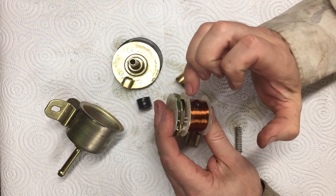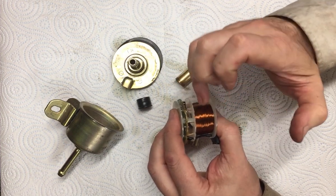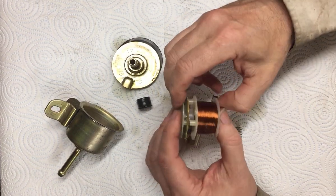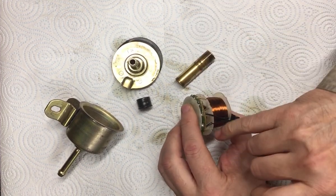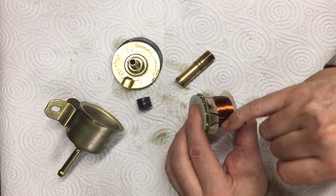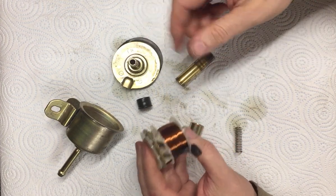So we've got a transistor there, a diode. That could be for when the magnetic field collapses, so it doesn't blow the transistor. Got a resistor there, and then a capacitor in there, that could be another diode. Yeah, it looks suspiciously like the input diode. So we've got a capacitor there. It's a simple timing circuit, and it just goes tick, tick, tick, tick, tick.